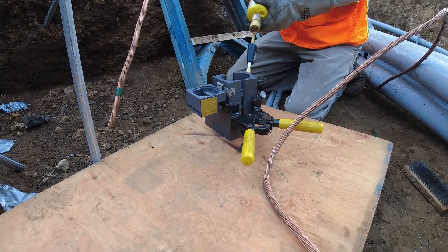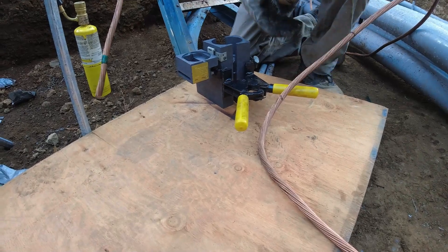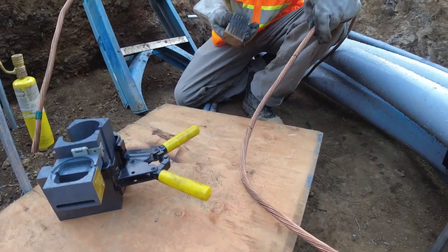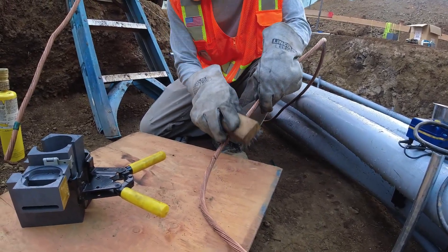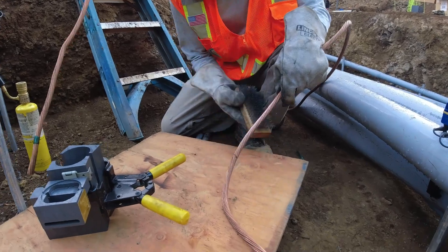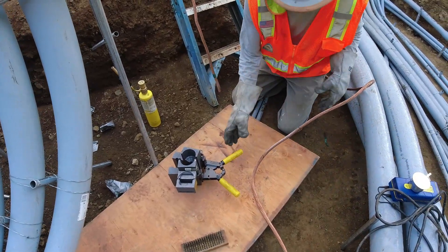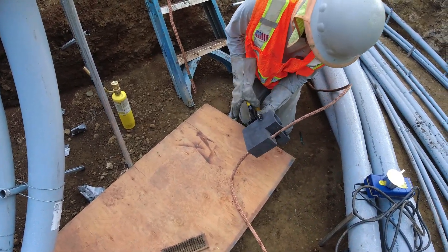Now you need to brush the copper — you're just getting the oxide off the outside, just like if you were doing copper pipe. Back and forth like that, just on center. We know you put those marks two inches higher than the mold so it doesn't matter up there. Just dead center is the only place you really need to hit, all four sides, and then you're good. Load them into your rig and then we'll look at how we're going to keep it from falling over while the firing happens.